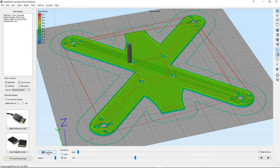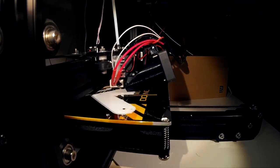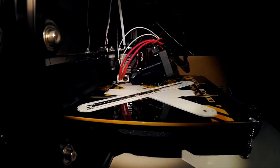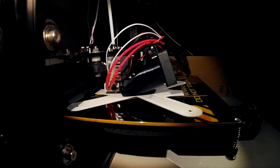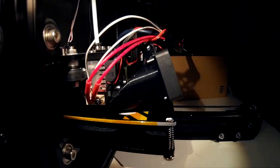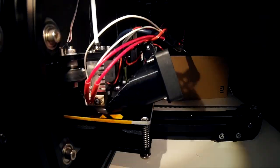After I was satisfied with the preview I went straight to printing it, which is what you can see right now. I used white PLA. So far I have printed almost everything with PLA since it is quite stiff and I have good results with it for my micro quad frames. I chose white filament because it's something different compared to all my black quadcopters, and maybe it will not get as hot in the sun as a black frame would, which is an issue for 3D printed stuff.